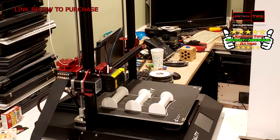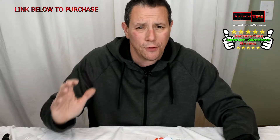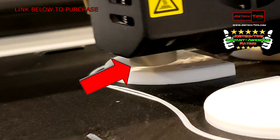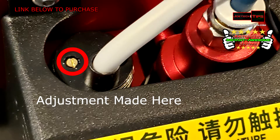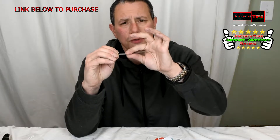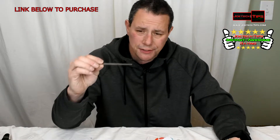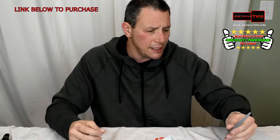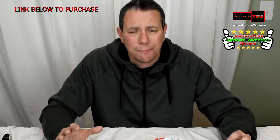At first, I wanted to throw the printer against a wall. I thought it was the biggest piece of shit — I couldn't get it to print for crap. Eventually, I figured out the problem. There is a sensor on the 3D printer extruder that tells you how close you are to the platform for printing. It does come with a feeler gauge — a 0.2 millimeter feeler gauge — showing how close it should be to the bed when it prints. And I'm telling you folks, it's probably a little bit thicker than a strand of hair. It's got to be really close to the bed, the playing field for printing. It is quite impressive.